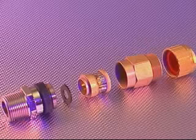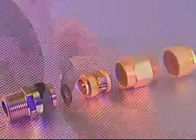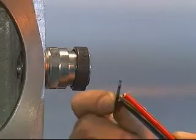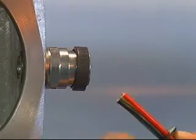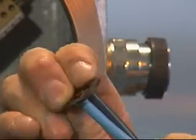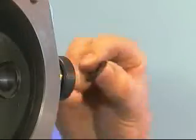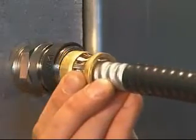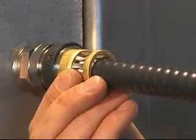Cable gland installation, 701. The installation process for the 701 cable gland is different from the 711 or 713 in that no compound part is used. Pass the cable through the cable stop device. If the cable conductors pass through, it should be left in position. If the cable conductors are too large, then the cable stop device should be discarded. If the cable stop device is required, locate it into the entry and feed the cable through until the cable sheath is in line with the back of the grounding device.